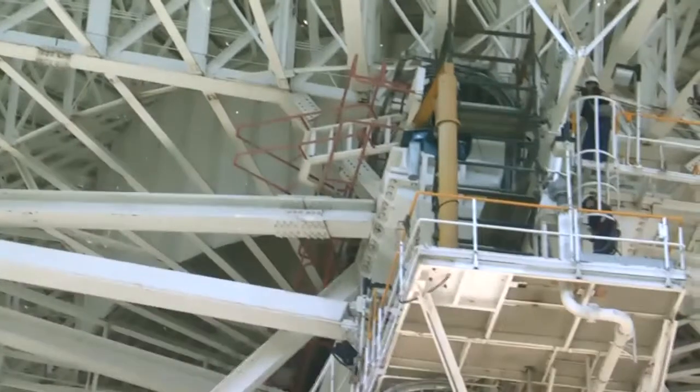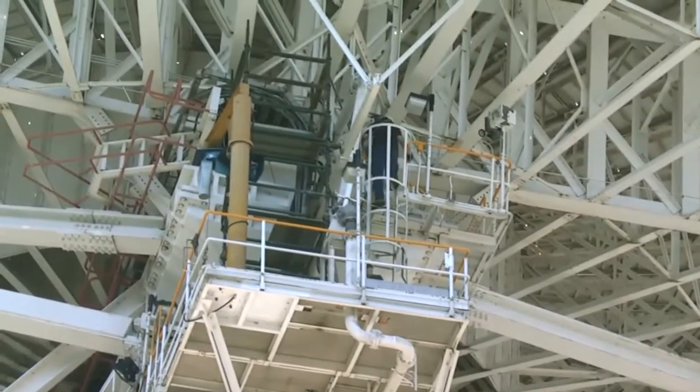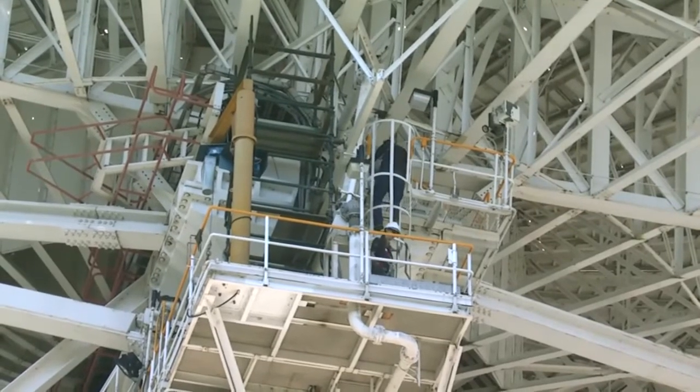And of course, the other side of the coin is that for a given size dish, if you go up in frequency, you actually get, correct me if I'm wrong, more gain from the same size. Right, the antenna becomes more sensitive. Because as you go up in frequency, the beam will keep on decreasing.